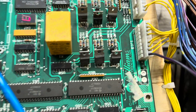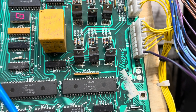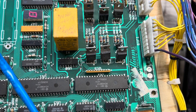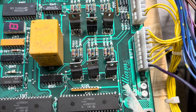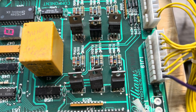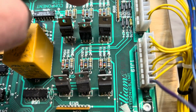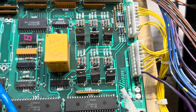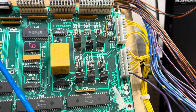Then this drive transistor in the special solenoid section can't handle it. It's driving a dead short or a resistive load that's way below what it should be driving, and it's going to explode. You've seen many System 11, System 3 through 7, and System 9 MPU boards that look worse than this one. This one had some issues in the special solenoid section — that's the way I got it. I repaired it, but we don't need to subject our boards to this kind of mess.